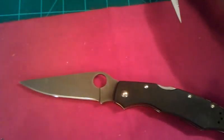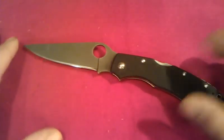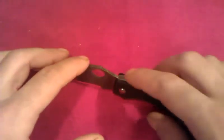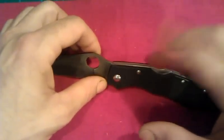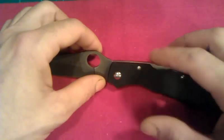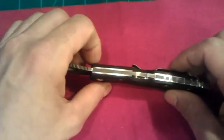If you're going to do the acid wash on 440C or something like AUS8, I'd pull it out every 15 minutes to see the acid effect — 15 minutes is fine for whatever steel you're using. Also, something I learned: I used fingernail polish to protect all the critical points like the inside of the pivot where the lock back meets the blade and anywhere tolerances had to be maintained. But only dipping it 15 minutes, you can probably get away with just using a Sharpie, because I had to soak it for a long time to get that nail polish off and a Sharpie would have come off like nothing.